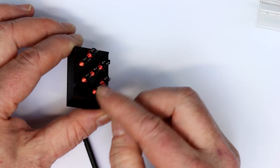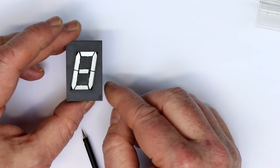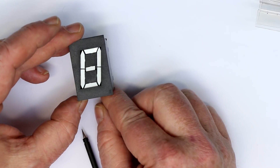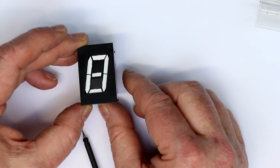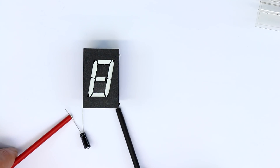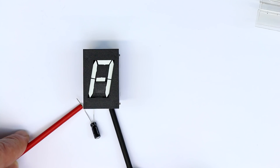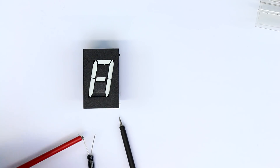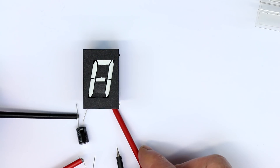There are seven coils for each of the seven segments. To flip them in or out, you have to put a little current pulse. The datasheet says 19 volts for one millisecond at 300 milliamps. To simulate this, I've connected a little aluminum electrolytic capacitor to a 19-volt power supply. And that was how to flip a segment out. Now with reversed polarity, that's how you flip it back in again.